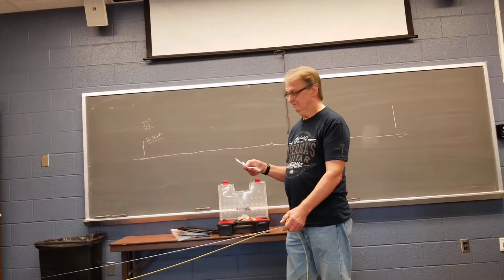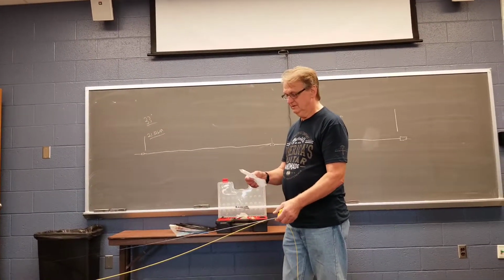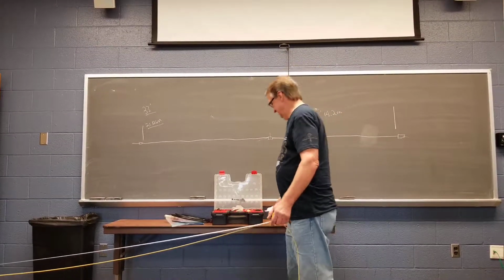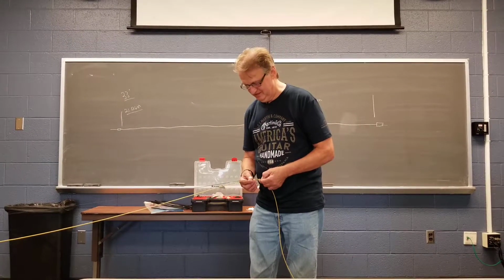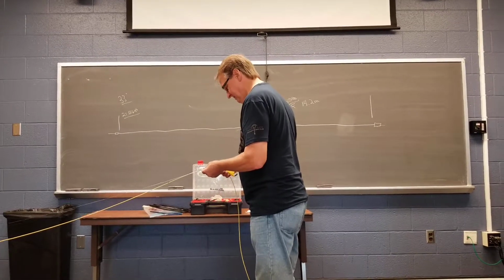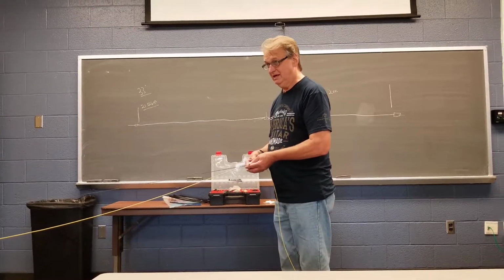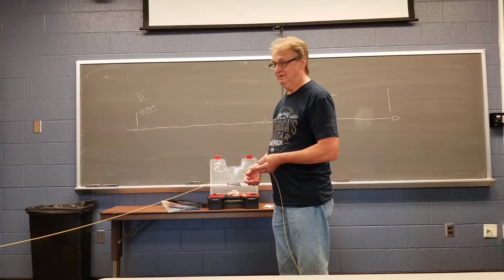No, you said from one end to the other end, it's 21.26 meters. That's 69 feet, but that's only if it's a full wave antenna. Your 21 meters is a full wave, right. But what are you making, a half wave dipole, aren't you? I'm making the half wave, yeah. But we need two of them. That'll make a full wave antenna.